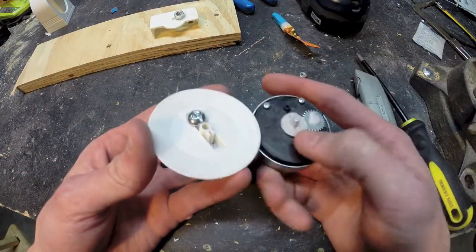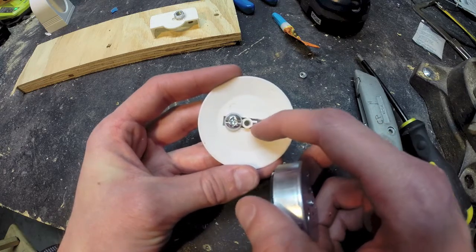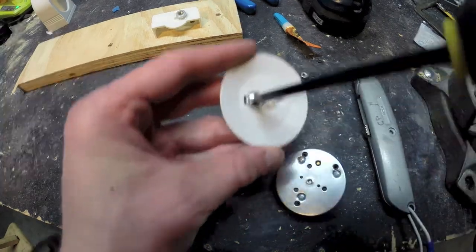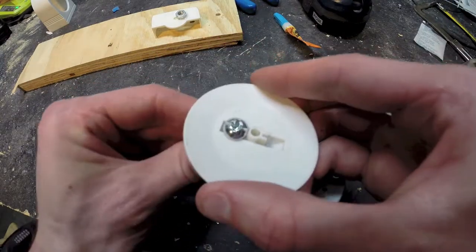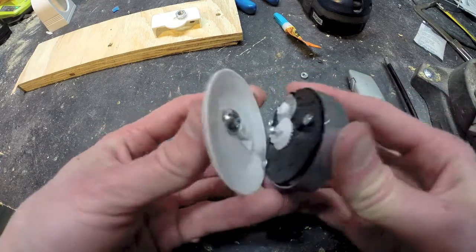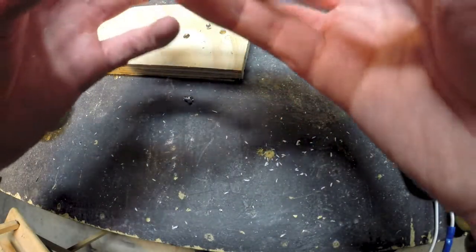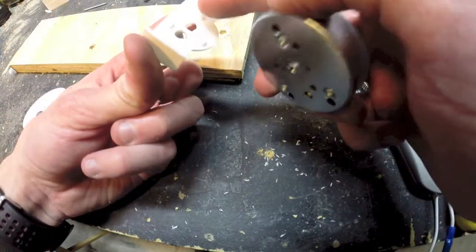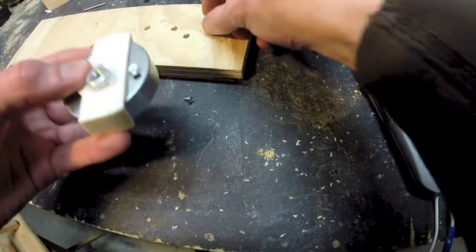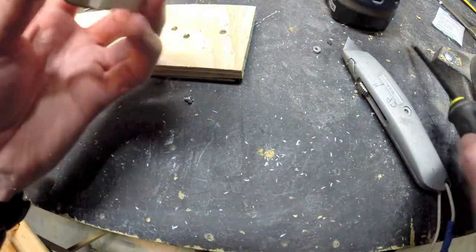While that's drying, I noticed that this bracket has two little nibs on each side, and one nib fits onto each side of this. We cut off one of the little brackets that the nibs fit into on this side, so I made sure that my screw — this one has a flathead that goes all the way across — will accommodate just so the other nib will fit into the flathead part of the screw. Just right. Now that we've got this together, let's go ahead and take our housing and the plastic bracket we've made. There are three little nibs here and three holes here — line up your flat ones together. Now it sits in there nice and neat. Drop that screw on top. Now it's mounted on solid.